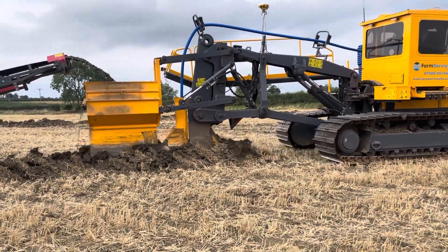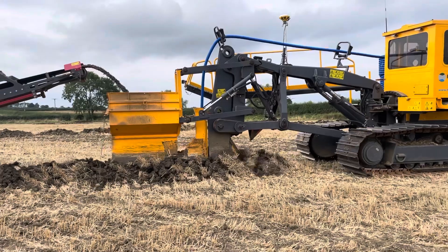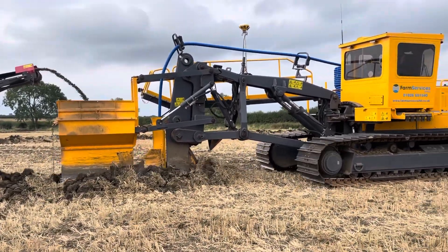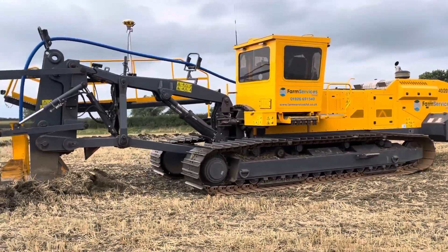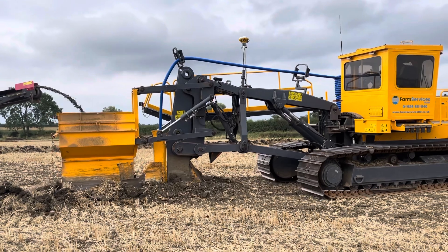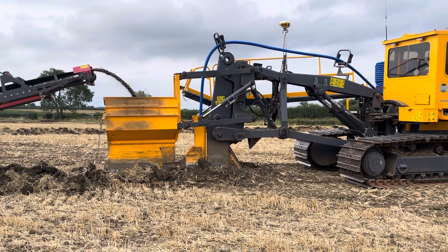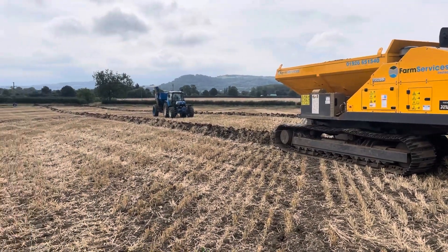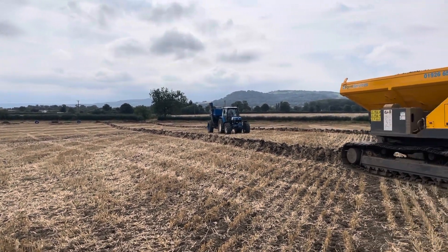There's been quite a lot of soil at the top here, but by the time the digger's just driven over that and firmed it all back in, that will all hopefully ride down nice and level. The machine itself is using GPS technology and lasers to map the field and create the right angles to enable the water to flow down these — what we call laterals — that feed into a main drain that runs along the bottom headland before emptying out into the ditch.